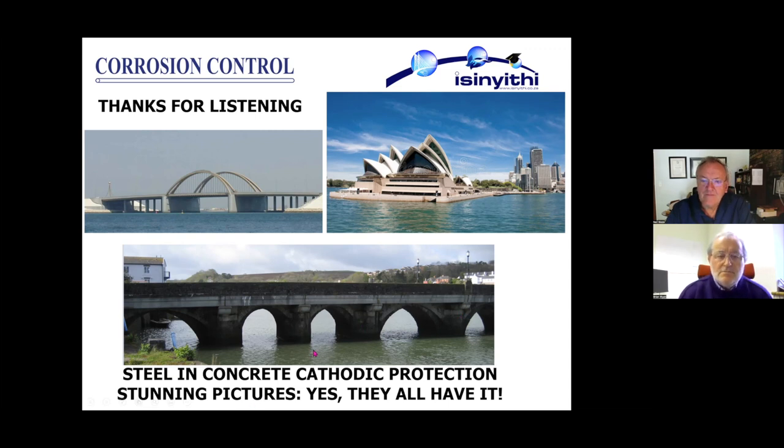That reminds me of a similar episode in southern Africa where they built some pre-stressed concrete pipelines using beach sand — not so successful. The Sydney Opera House does have cathodic protection of steel in concrete in some areas, applied about 10 to 15 years ago; the structure is probably 40 years old now. It is a very successful, very carefully designed and implemented system. The other example is Bideford Long Bridge — one of the longest and oldest stone arch bridges in the UK, in the southwest of England.